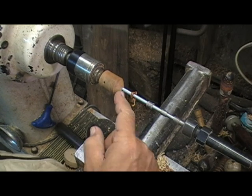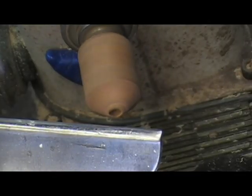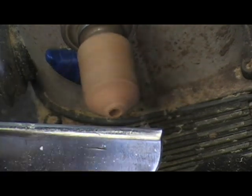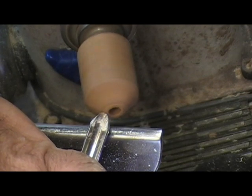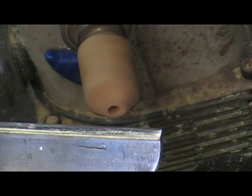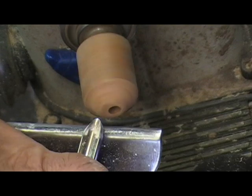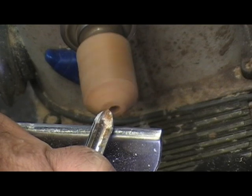I'm going to face it off so that the bushing flattens up against it. Lathe speed is about 2,000 RPMs — I just don't want it to crack this off. I'm going to take some real easy slicing cuts. If this was denser material it would work nicer. In fact, I have to go find some Corian — I'm pretty sure this would be awesome out of a chunk of Corian. But I used a piece I had laying around.